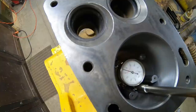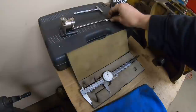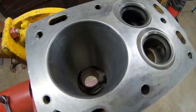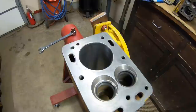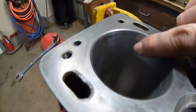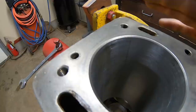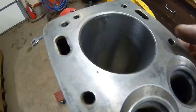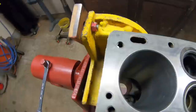Okay, just checking our taper - we're perfect, that bore is already concentric. All I did was one more pass through just like I did prior to this, and look at that - we've pretty much taken all the low spots out. We've pulled about five thousandths out. I've got my bore gauge set at 2.750 - we've already ripped five thousandths out of that cylinder wall and I've only got about two actual minutes of honing on this. We've got a pretty deep score right here, you can still catch it pretty good at the top with your fingernail. I'm pretty sure we're going to be able to cut that out. These aren't race car engines - they're like a glorified lawnmower engine - but I think that's coming out. We got a little bit of water damage here, some minor pitting, and I'm pretty sure we'll cut all that out too.